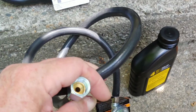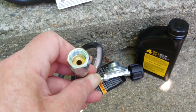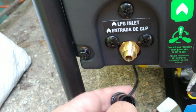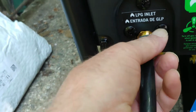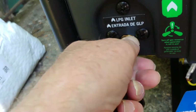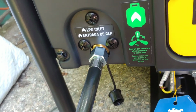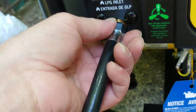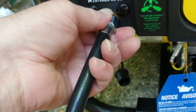Okay, when talking about these gas fittings, notice on the end it is tapered, and that can fit into this guy right here. This is a rubberized fitting. It is righty tighty, lefty loosey. Okay, if you have a crescent wrench, what I'd recommend is getting a spray bottle, soapy water, a crescent wrench, this guy right here. I don't recommend a torque wrench, but if you have one, that's nice, but just make it tight where it's not spinning like that.